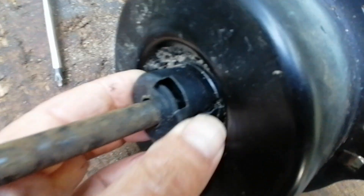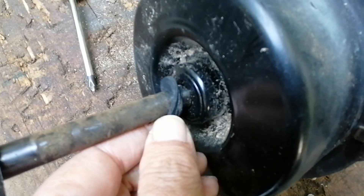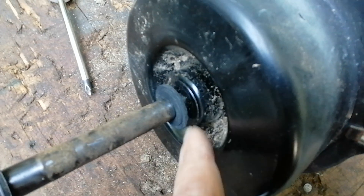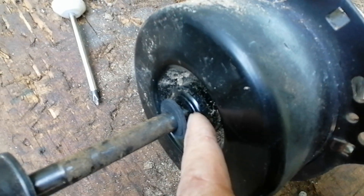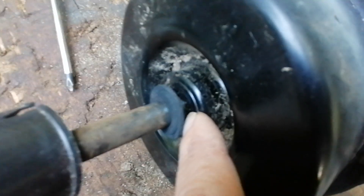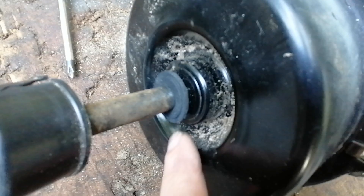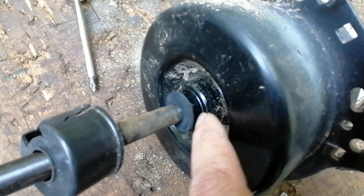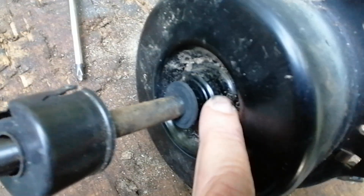This goes on the condenser side. Here you've just got this plastic piece with a slot cut into it — that lifts out — then you've got a rubber washer here. There's actually a groove that this washer sits in, and it's not touching the actual motor case. If you're soaking this with a hose, water is going to leach in where the shaft goes in, and there's no seal inside these cases — just a thrust washer and then the bearings sitting right there.